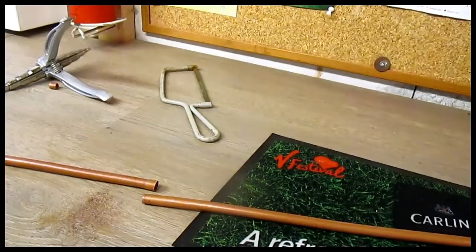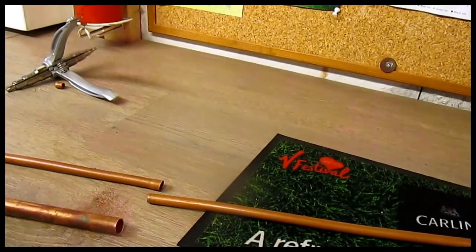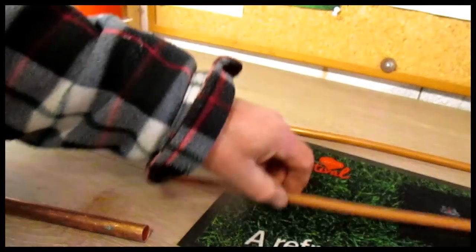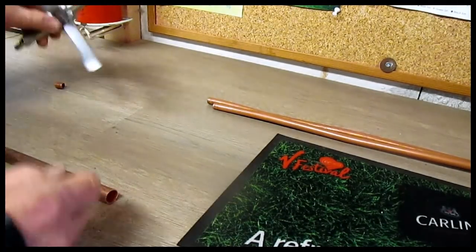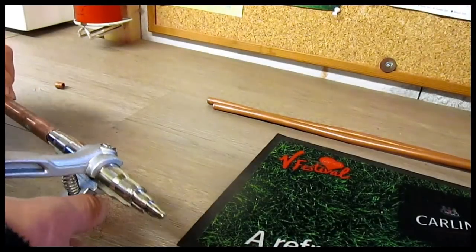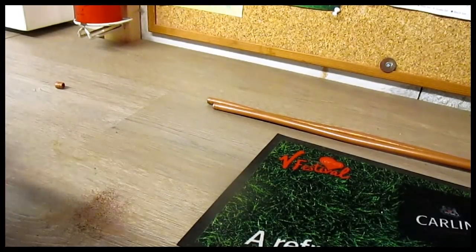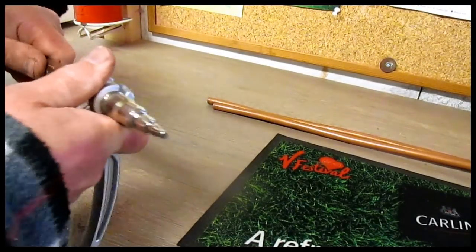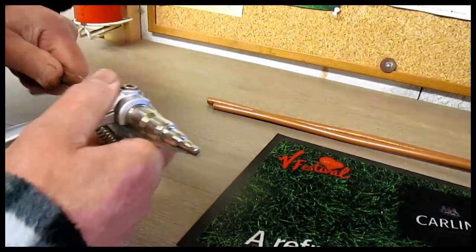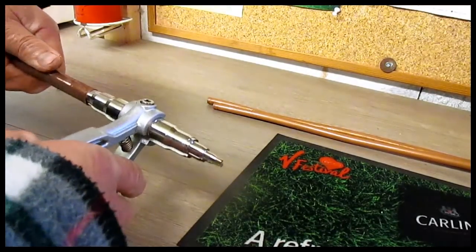But we're not stopping at that, because next we're going to go to the 15mm size and see how long it takes to do one of those. So there's your 15mm pipe and I've done the same thing there by sawing the end so that this will fit in easily. We'll go down to the 15mm size which is that one. And that is a bit tough to get on to be honest, so we'll give it a couple of squeezes - it soon opens out.